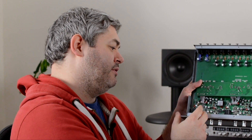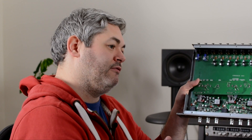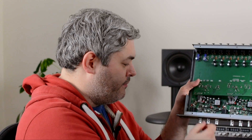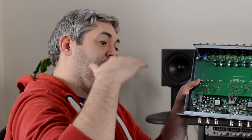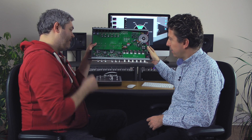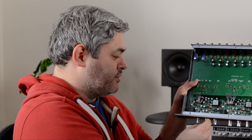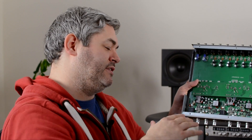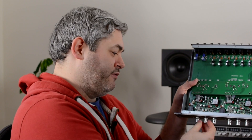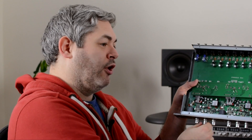The transformer on its own, for Iron, is quite a subtle device. What people like about them is the fact that they're coupled with amplifiers that eventually struggle to drive the transformer or run out of headroom, but they're still Class A — so they're inherently quite smooth, and when they do distort, they have a very musical overload. HMX uses three of them with a pot that turns the gain up to amplify and distort, whilst also turning the output down — so it's mostly level-compensated. You don't hear it get loud. As you boost more, there's more gain, a bit more noise, and more soft saturation. There's also an emphasis filter that boosts the low end around 50–60 Hz, almost like the bump you'd find on a tape machine — a tubey saturation with this bias frequency.